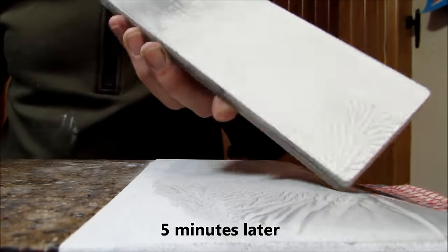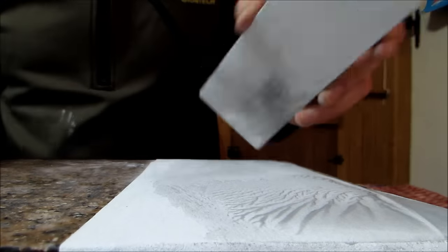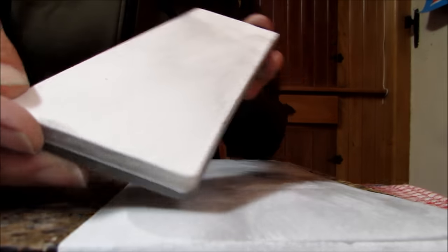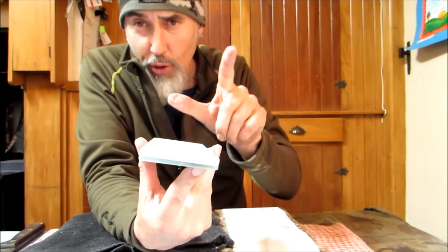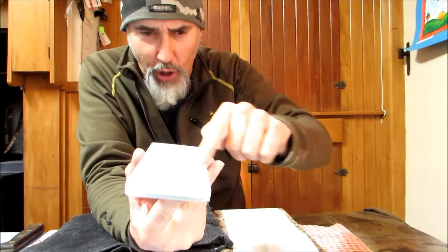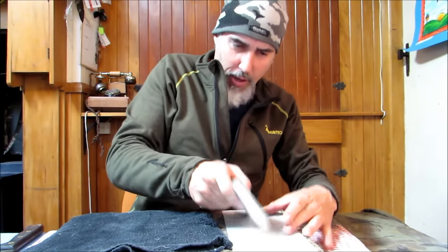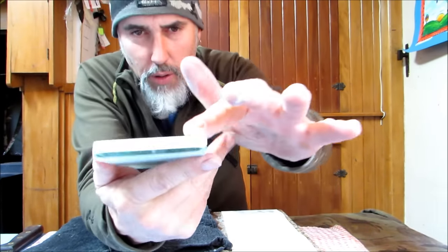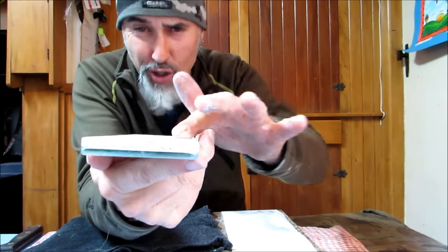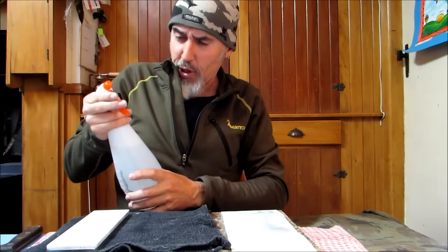Okay, how are we looking? All right, we've got a little bit of a dip here, and this looks pretty clean. We'll give it a bit more and we should be flushed. That's pretty good. So the stone is dressed and we can get into it and start some sharpening. One more thing I do need to do though is take the taper off on the outside, that sharp edge — just a quick rub on both sides and on the ends. That's nice and smooth. Just stops the knife catching it. This particular stone you don't have to soak like some — just spray a bit of water on and you're good to go.